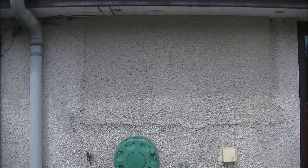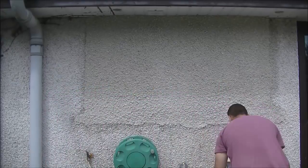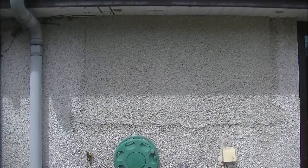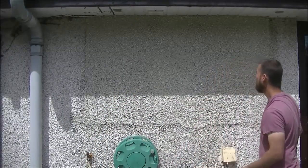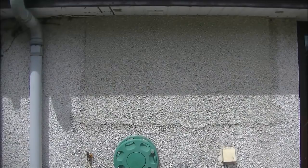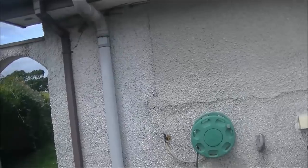You can see the job is more or less completed. It's really all down to your preparation and obviously experience will help you - the more you do these jobs the better you'll get at them. With the double coat I find it gives you a wee bit more time, so unlike part one where you have to coat and dash, coat and dash, sometimes you can get it all on in one go. Just keep an eye on it, don't let it dry too much. If it starts drying and you're coating left or right you might want to get your left side dashed first.